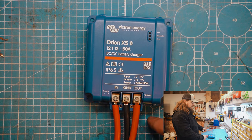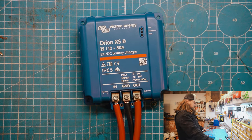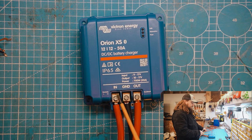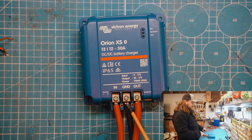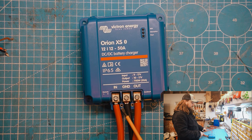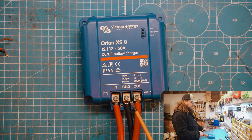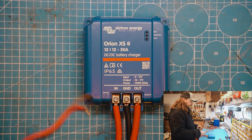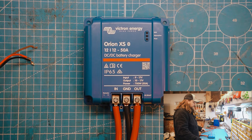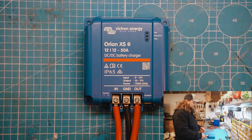I've got a few examples here of the type of scenarios or circumstances that you might find yourself in. From left to right: we've got a 16mm wire with a four-sided ferrule in the terminal, in the middle a 16mm wire with no ferrule, and on the right a 25mm wire with no ferrule. We're going to try and put the Battery Master into each of these to demonstrate whether it's possible.